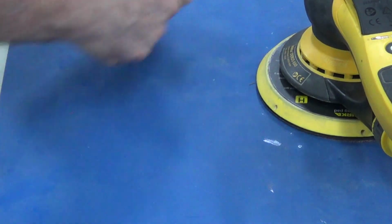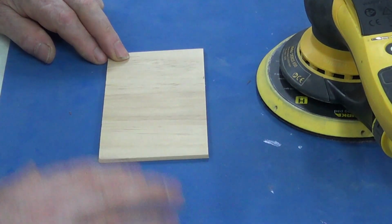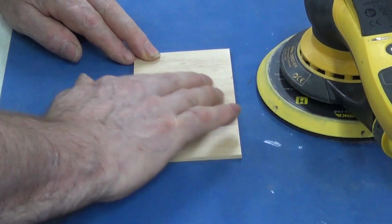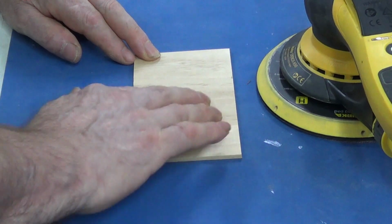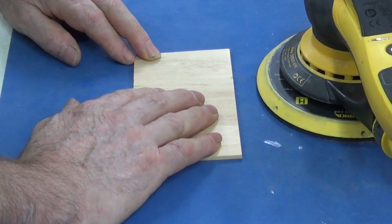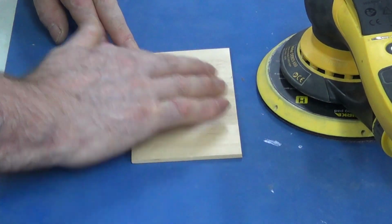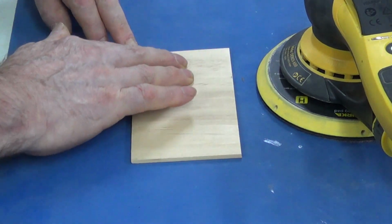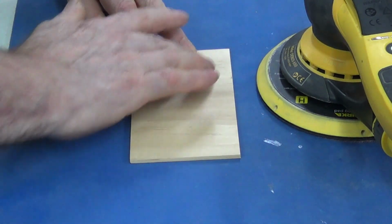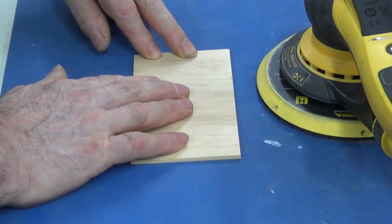Normally I just get a bit of wood and start engraving. Well, this time what I'm going to do is I'm going to sand this a bit, because this has been sanded, I think, to about 150 or 180. I'll sand it maybe up to 240, maybe even 320. What that hopefully will do is it'll sand away some of the pores to the point where you won't have the gaps there for the filler to sit in.